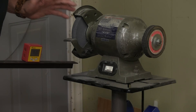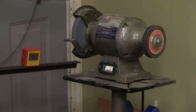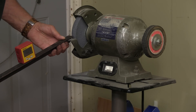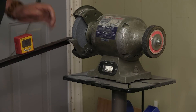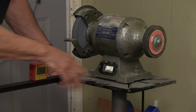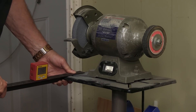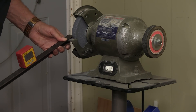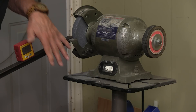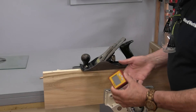Here's another use: the grinder. Maybe you're setting up a sharpening tool or jig and need to set it at 25 degrees, which is a very common sharpening angle. There are a variety of jigs that attach to your grinder — woodturners will know all about this. Simply find the flat deck of your grinder, zero your angle finder on that, then move to the area where you want to set the angle. Now you have a zeroed reference surface and can set whatever angle you need.